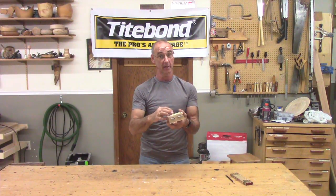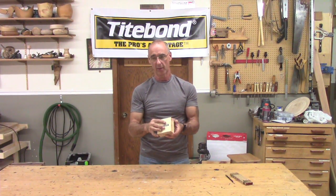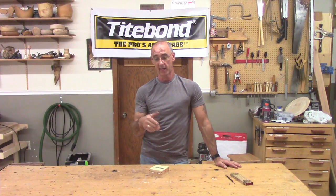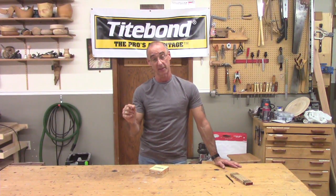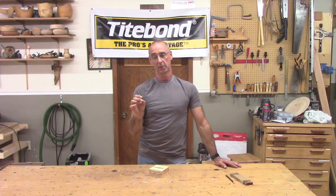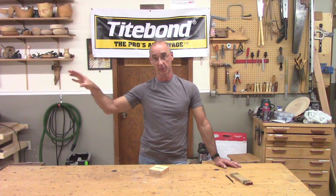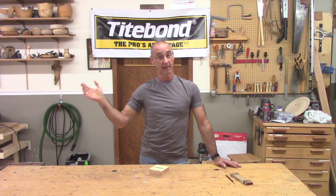The theory is good, but the practice isn't always as good, because although we want to call plywood 23/32, it very rarely is exactly that. In fact, a dado I cut just 2 days ago was only a tiny bit over 11/16, so even less than 23/32. My feeling is that there are two good approaches to this. One is a stackable dado head on the table saw, pointing my table saw over here. I think that will lead to the best possible fit that you can get at the table saw.